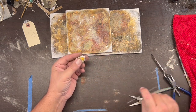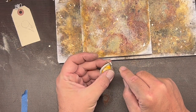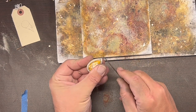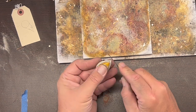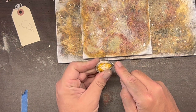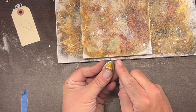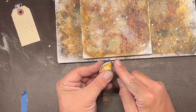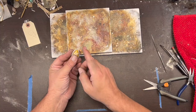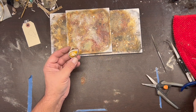In order to make that actually happen a little more easily, if you actually thin out the bezel right at that point just a little bit, maybe to make it half as thin, just right at the top, you've got to be careful. The bezel is already pretty thin. But if you just thin that end point out just a little bit, it gets rid of just enough metal to where it makes it easier to compress what's left into that space, even though it normally would have a tendency to wrinkle.